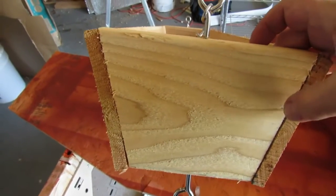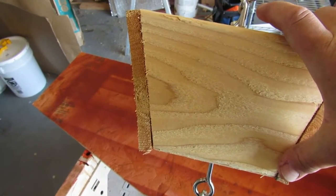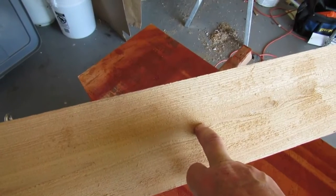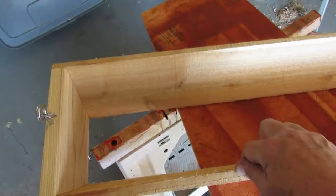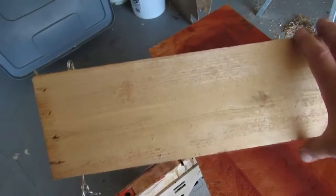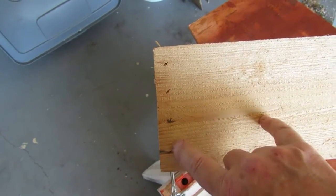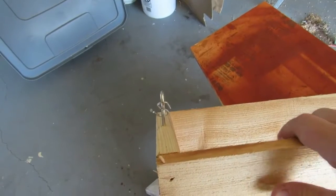It's based on the exact same dimensions. This is five quarter inch decking cut on a 15 degree angle with four and three quarters inches from edge to edge at the bottom. The sides are one by five cedar fence rail and the bottom will be the same thing. The cedar fence rail is a little bit less than three quarters inch and these widths are not all created equal, so you have to be careful. We cut these to 36 inches long and then with a pneumatic nailer used staples at four spots on each end and on each side to fix them in.